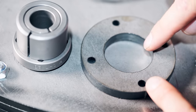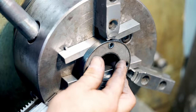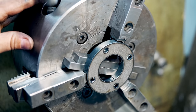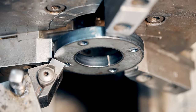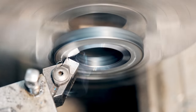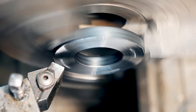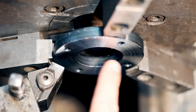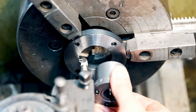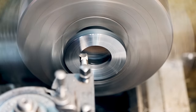We're ready for our first job. We're going to open this inner diameter to 42 millimeters for the tapered bushing. We used two parallels to get it parallel to the face of the chuck. We cleaned up with a face cut and a small chamfer. We have a new setup with a boring bar and now we're going to open this ID to fit the tapered bushing. We're not measuring anything — we're going to take a very small cut, try to see if it fits, and continue until it fits.